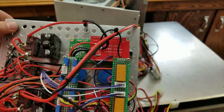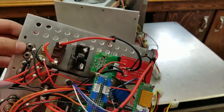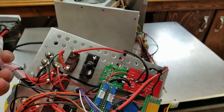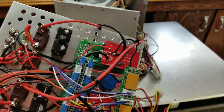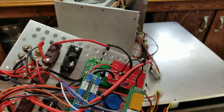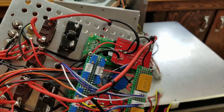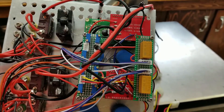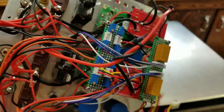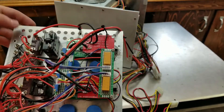At 50 volts with around one-something amps, that should be more than enough for electronics purposes, and this is meant for electronics only. If I need higher power, I have a different power supply for that. At lower voltages — say 25 volts — we'll be getting close to 3 amps, so that's fine. Plus, if we want more current, we can always use two ATX power supplies in series and get 24 volts at 10 or more amps. So no worries whatsoever.